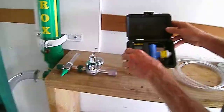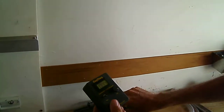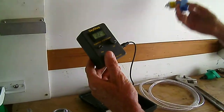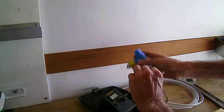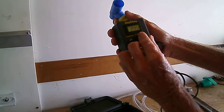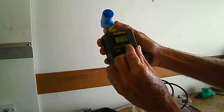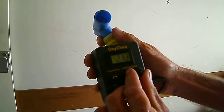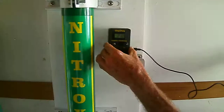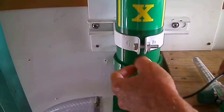We're going to show you how to set this up. You take out the analyzer, you turn it on, you hook the electrical cord into it, and then you hook the sensor onto it. You shake it, kind of get some air through it so that the OxyCheck goes to 21%. That's close enough. Set the OxyCheck in the rack and hook the sensor up.